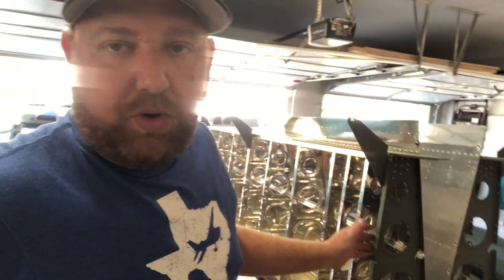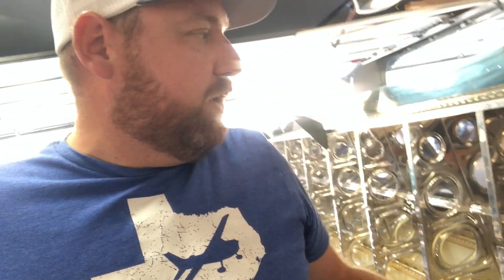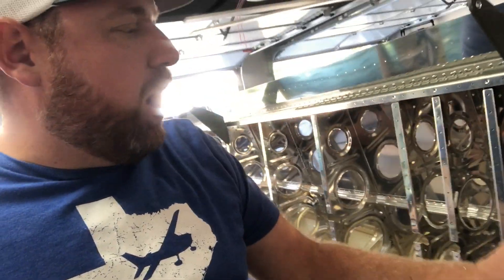The kit I ended up buying was not primed. The builder was very careful — he primed parts that were either not alclad. My understanding of alclad is it's a pure aluminum that's very corrosion resistant, but also very soft and susceptible to scratches. Anything can corrode under the right conditions, but the builder was very careful to prime using a self-etching primer, and he prepped the parts properly — any parts that are exposed or not alclad.